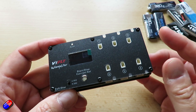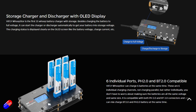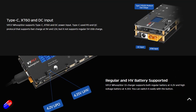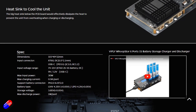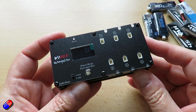The specs on this: 101mm × 49mm × 22mm. Input voltages are 7 to 21 volts, so that's a 2S to a 5S battery. The USB-C connector is for high-power connections — 9 to 12 volts — so it won't run on a 5-volt supply, but if you have something that talks to it as a charger, that's going to work. Maximum input power is 30 watts. Maximum charge current per port is 0.9 amps. It's got PH 2.0 and BT 2.0 connectors for each port, and there are 6 ports to charge from.